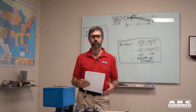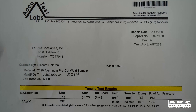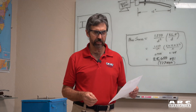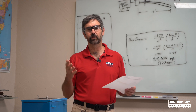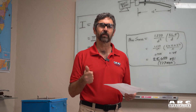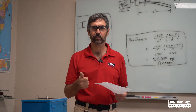We made some additive manufactured parts out of 2319 aluminum, which is a copper alloy aluminum, and those you can actually solution, heat treat, and age — which is what we did here in the laboratory — and our results are quite good. We're up to 63,000 PSI tensile. This is up to steel levels, so now we have a material that weighs a third as much as steel but has equal strength. The answer to the question — can you weld heat treatable aluminum alloys for additive manufacturing — the answer is yes.